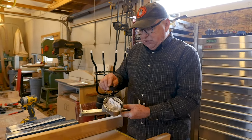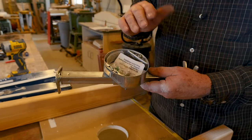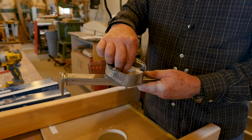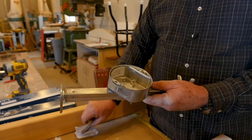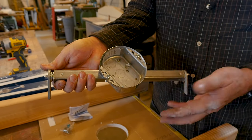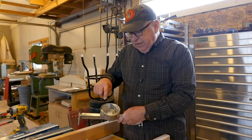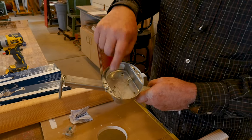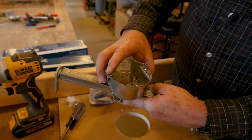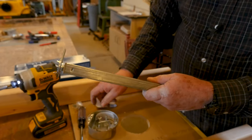When you open the remodel box, you get the same box as before but with no courtesy cover, since you're doing a remodel and not new construction with drywall, mud, and paint. There is a cable connector, a set of instructions, and hardware with number 10 screws for mounting ceiling fans. First, pull the box and bracket off using a three-eighths, or about nine-millimeter, nut driver and a Phillips driver to remove the screws. You can see they take mounting very seriously — there are four connectors that hold this bracket. Remove the bracket and set it aside.